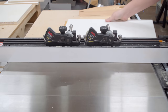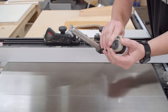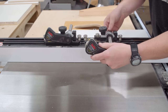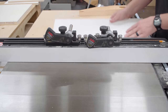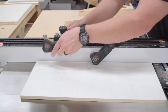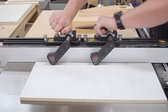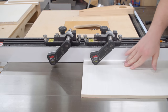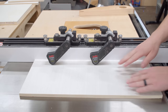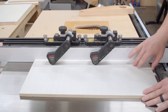A quick second to own up to my laziness. These are roller guides and on one side they have a roller that is grippy, kind of like a roller blade wheel, and it's off on an angle — not perfectly straight. When they are engaged, you put your material down and put this down on top of the material — just the black part. Tighten it down, and now they're perfectly set so that as you push material through, the roller engages and pushes the material up against the fence, nice and tight. They only roll in one direction so you can't pull back, which greatly reduces the chance of kickback.